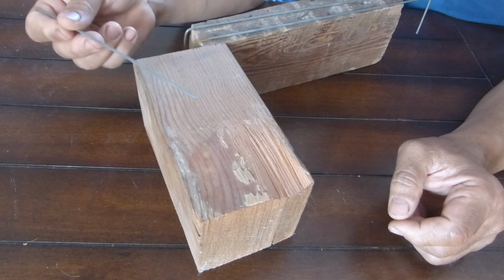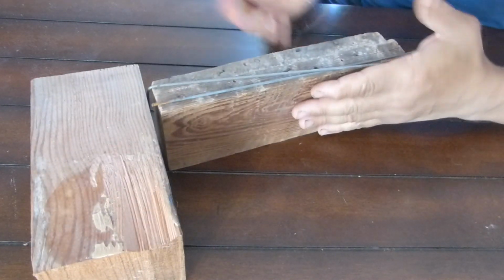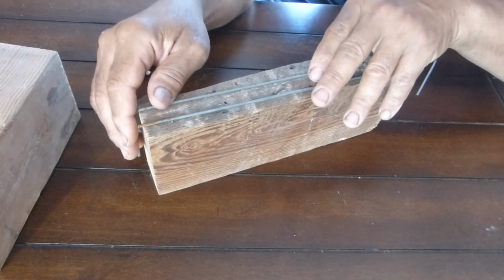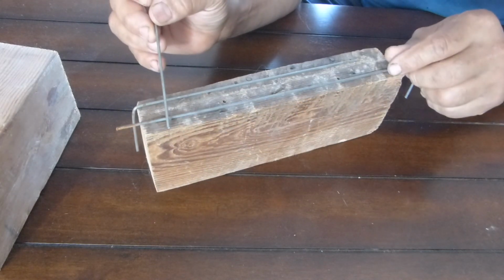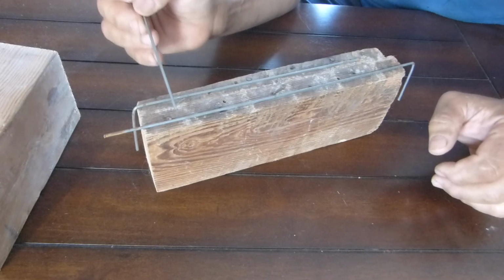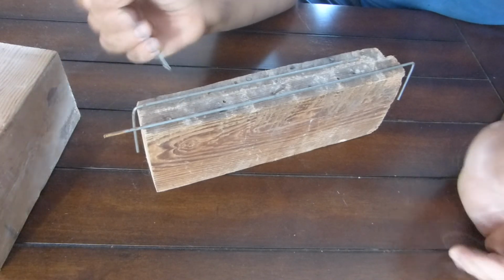What failed is the bond between the rebar and the concrete, the marriage, and that was done through deflection and breaking up this beam. Remember I said look at this as a beam. I want you to section the floors everywhere. And if you look at it as a beam, as you section the floor, you'll see that there's no stirrups here holding it together. There's no stirrups. So what holds it together is the one thing ACI says concrete is terrible in, and that's in tension. So what holds this top piece and this bottom piece together? The concrete between here and here, the paste, the mortar mix, the tension of the concrete's ability to bond. That doesn't make sense, does it?